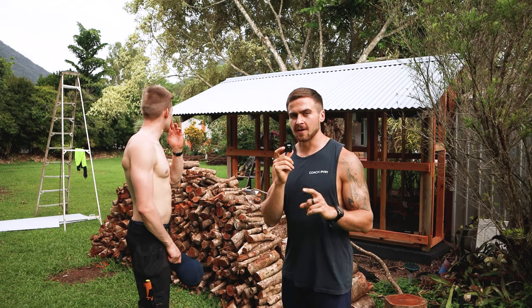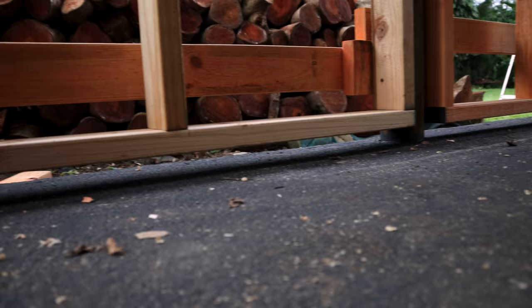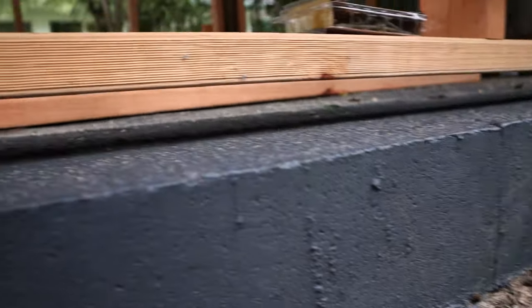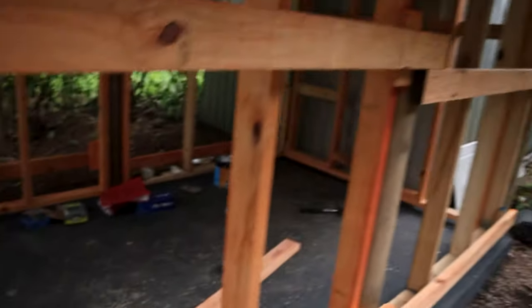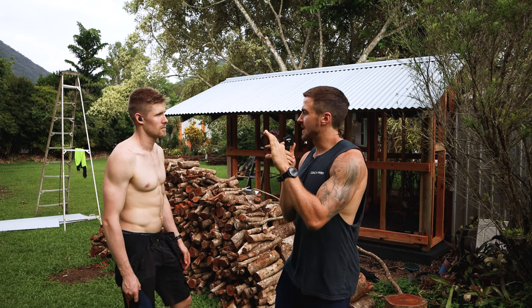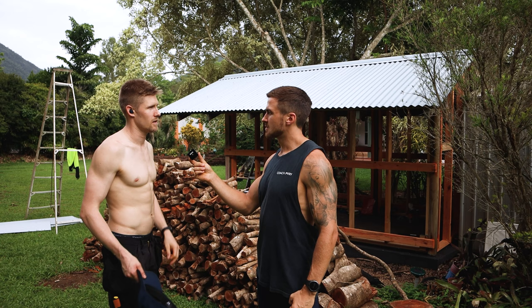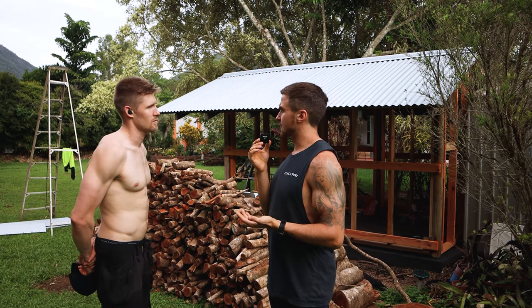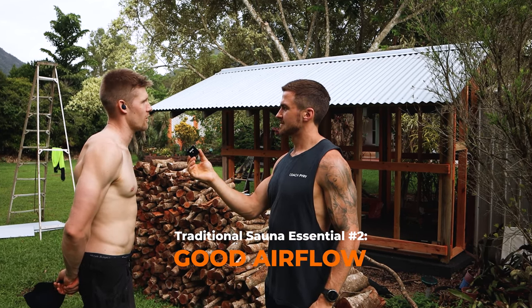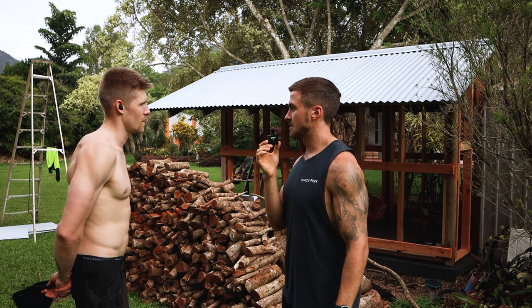We've actually got a little bit of a space between the wall and the floor — we're literally going to leave it open. We'll put a screen there so that rodents and wildlife can't crawl into the sauna. The air can move and dry easily. It's important for a good löyly to have good airflow — fresh air coming in from the bottom and going out from the top.